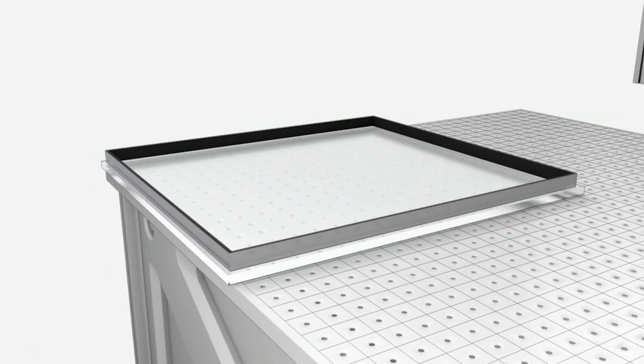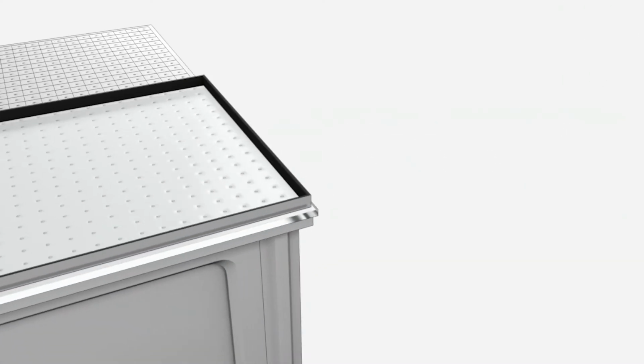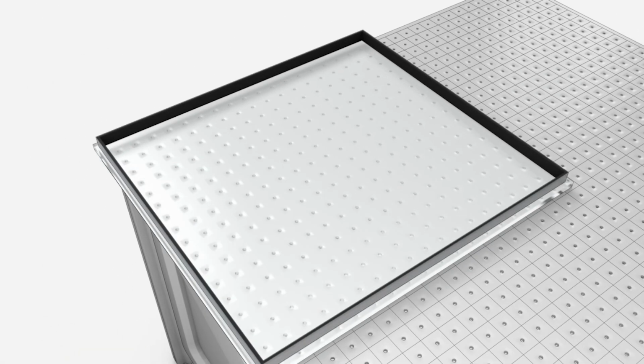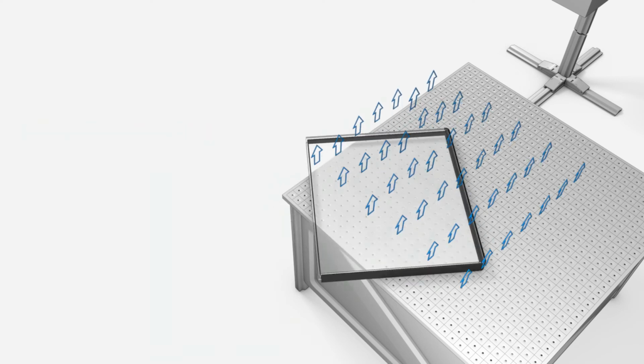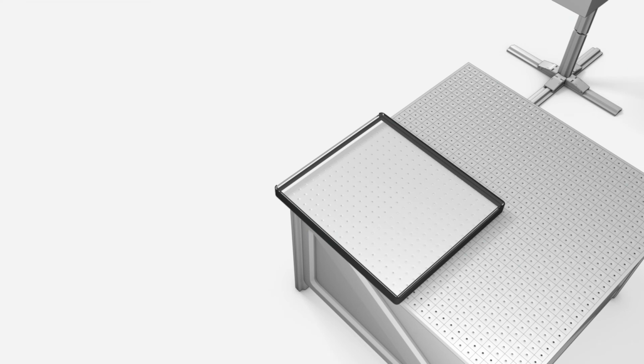Now your spacer has been applied to one pane of glass, it should look like this. You can now align the second pane of glass to the top of the first. A vertical alignment rack helps to ensure exact symmetry of glass panes. A hot melt secondary sealant must now be applied between the two panes of glass along the back edge of the Thermoflex warm edge spacer. This is quick and easily done on a rotary table or clamp table. Apply the sealant along the back of the spacer on all four sides of the unit. This completes your double glazing sealed unit.